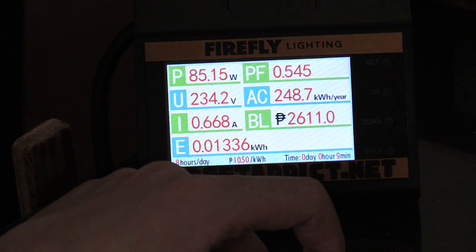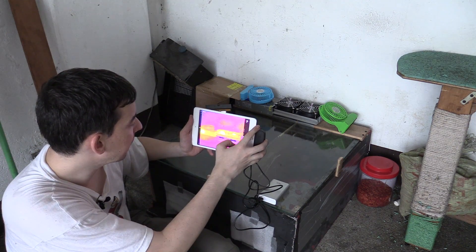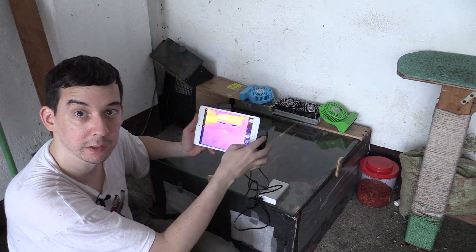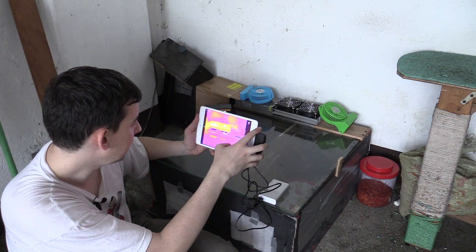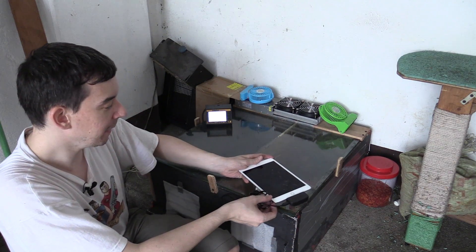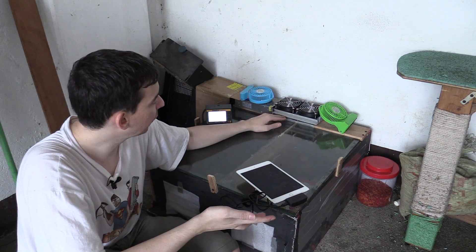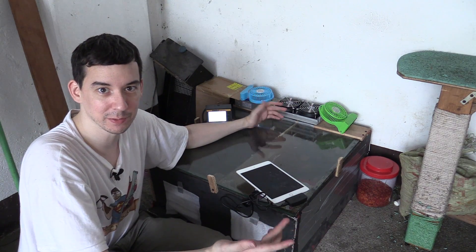Now you can actually add to that because during the making of this video I smashed my iPad screen. But anyway, it's been running for a while now and if we check with the thermal camera we can see on the hot side we're measuring anywhere up to 45–50 degrees Celsius. And on the cold side we're reading around — the best I've seen it is around 30 degrees, which basically means this is a bit of a failure because the hot side is getting so hot that it's also heating up the cold side. So we're not actually dropping the temperature — we're basically just matching the ambient temperature, which is 30 degrees.